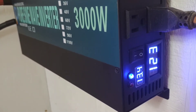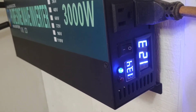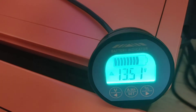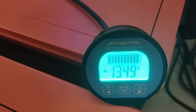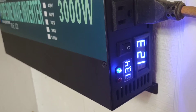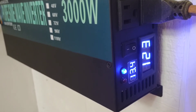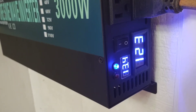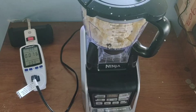Right now it's running about three amps off of it and it holds steady at 123 volts, showing the battery voltage at 13.4 — which isn't extremely accurate; it's really at 13.5. I'm going to throw different kinds of loads on this and show you how the voltage changes. Right now with just a few amps — charging a phone, tablet, that kind of thing — it pretty much holds steady at 123 volts. It takes a fairly large load to make it change in any meaningful way.